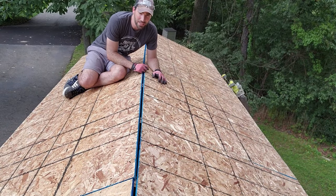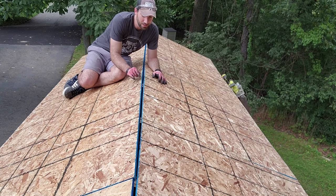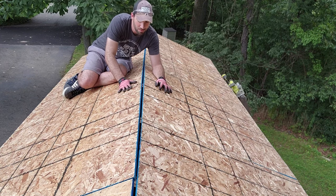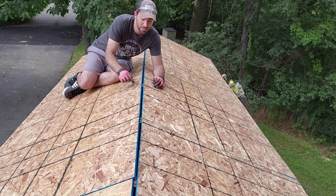It's gonna be 2 inches wide and run the 16-foot length of the building, right along the ridge of the roof. I intentionally left any fasteners at least 6 inches down from the top of the roof sheathing. Once I cut this vent, I'll go ahead and add a few more fasteners in at the top of the sheathing.